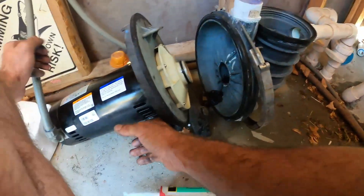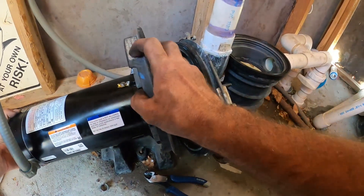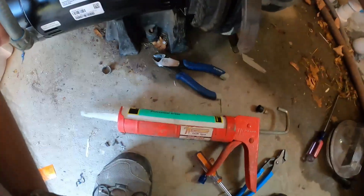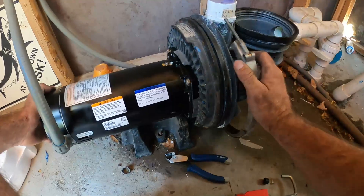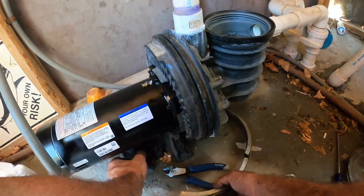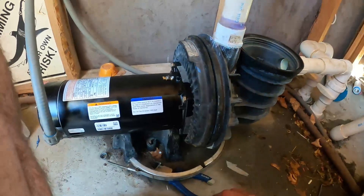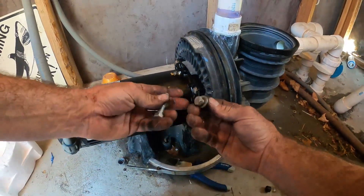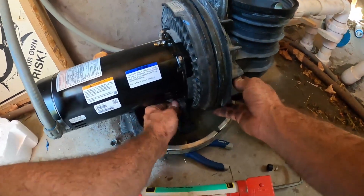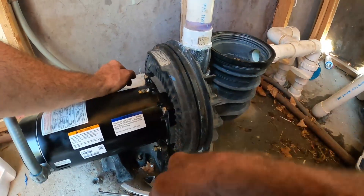Sometimes I'll feed this clamp ring inside here so it's easier to slip in. With that siliconed up, make sure the label for our pump model is on top. Work this thing into the wet end — there she goes, she pops in. It's just a matter of lining up the motor pump mount to the floor with the bolts on the bottom of the motor plate, then putting in the longer bolts with washers so they feed through.